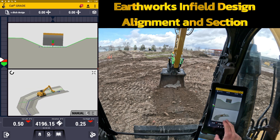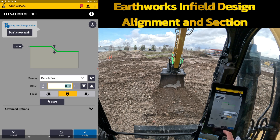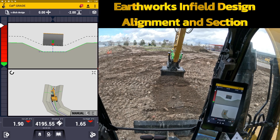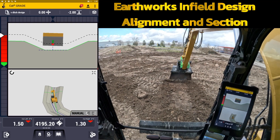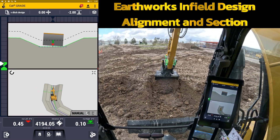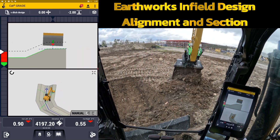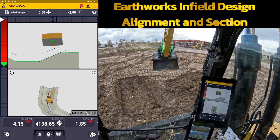Now we don't have that super high point in the middle. At this point you can change your vertical offset — I want to bring that down two feet, so I'll put in a minus two feet — and we can go to digging. We can start putting our spoils to the side and start referencing what the elevation is. You can see that I'm pretty close on that one. Now we can start cutting our slope in here.